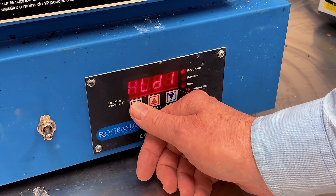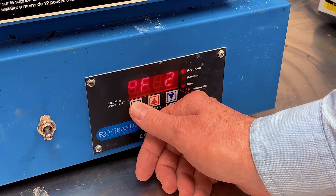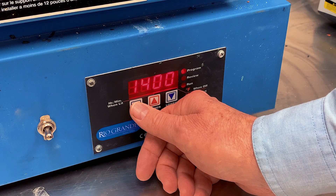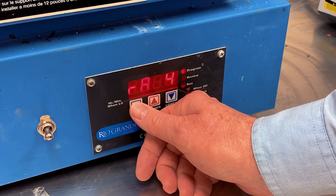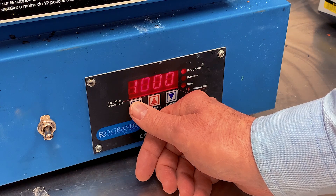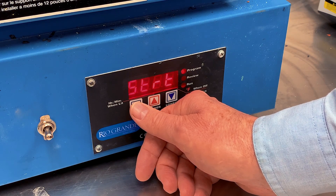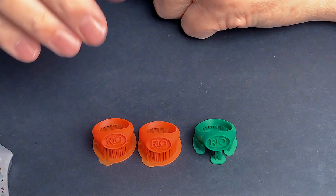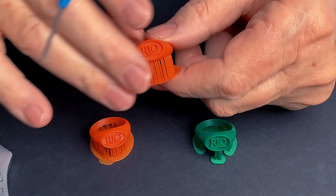My process was very straightforward. I used R&R Plastic Cast at a 38 to 100 powder to water ratio. I did take it a little bit higher to 1400 instead of the usual 1350, but I'll attach my burnout schedule so that you can duplicate my results. There are a couple of little differences to take into consideration when using Fast Wax. Since it has so much wax in it, it's a softer material and you'll need a denser support structure like this.